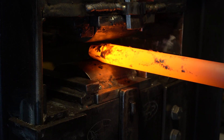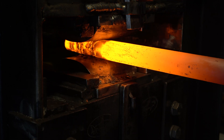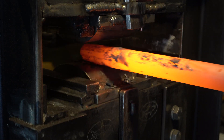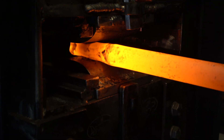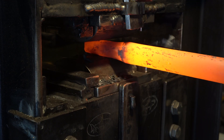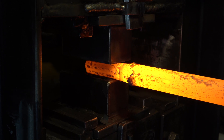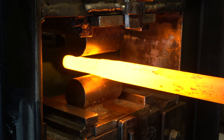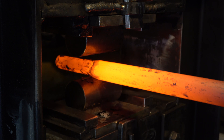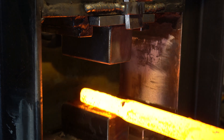I started by heating up this piece of S7 in the forge — it's about a one inch diameter piece. After heating it up I use the rounding dies to start to put a taper on it. This is the first time I've used S7 tool steel and it doesn't move well even under the press; I could not imagine trying to move this with a hand hammer. Making this punch was just a series of alternating between the rounding dies and the flat dies, just keep rolling it in those dies to make a concentric circle and get it as close as I could so there wasn't a ton of grinding after.